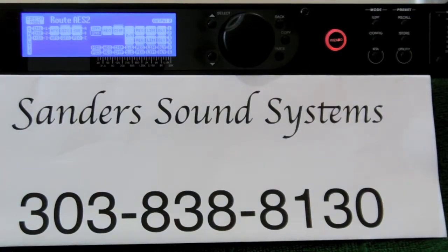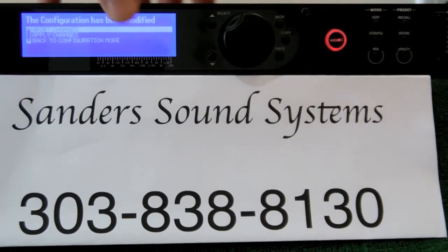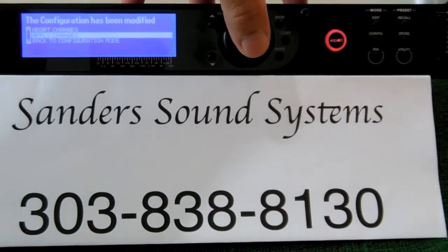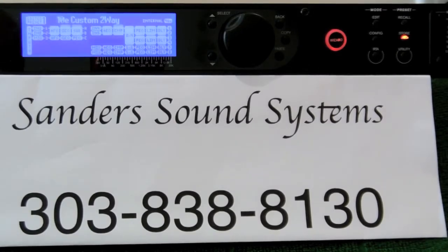When you switch to digital inputs, you will see that they are on inputs 4 and 5, so you will see IN4 and IN5 on the display instead of the analog inputs IN1 and IN2. Press the back button. The configuration menu will then ask if you want to save or abort the changes you just made. Select apply changes so that your changes will become active. Arrow down to apply changes and select it by pressing the knob inward once. It will configure — please wait. When it has finished, press the back button to return to normal operation.